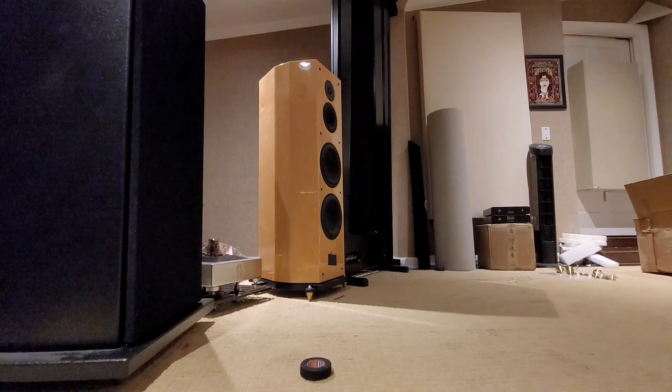That's the slope. So the slope can be 24 decibels per octave. It can be 12 decibels per octave, can be 6 decibels per octave. And of course, they're different. They are gradual all the way to very steep. Okay. And so you need to know your speaker, or you experiment to determine what slope you're going to use and at what point you're going to use.